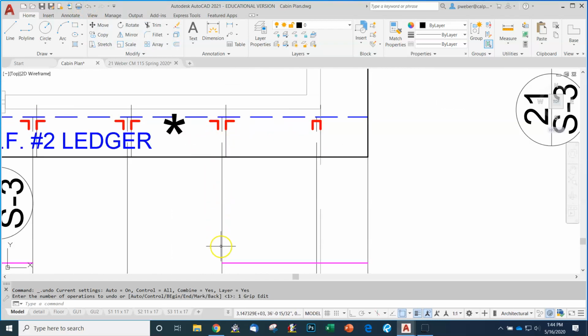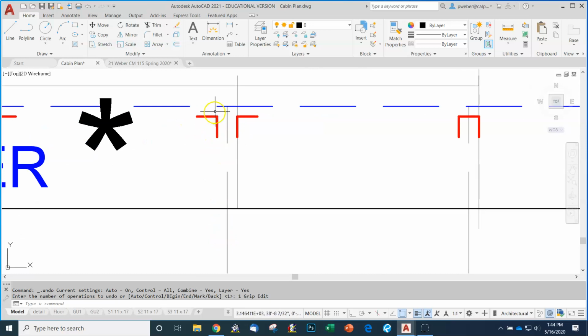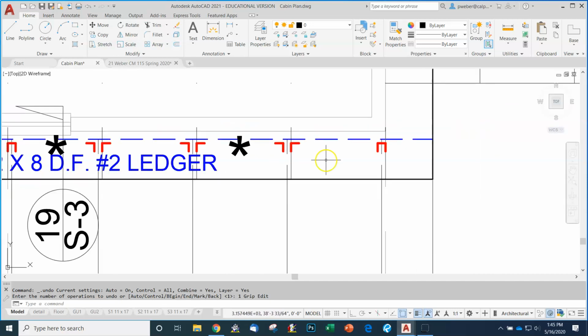But then at the sloping rafters, put two 2-inch long L's, float them away from the rafter, because this is a joist hanger. So you look at Simpson Strong-Tie and look for a U26 joist hanger. It's just a U shape of metal with ears here and ears here, so you can nail it off. These 2x6s will nail on, and this is the same 2x6. They nail onto a ledger. Go look at detail 19 in the detail packet, and float that ledger just a couple inches away from the house.